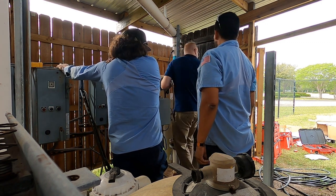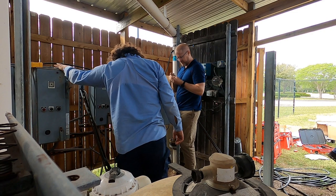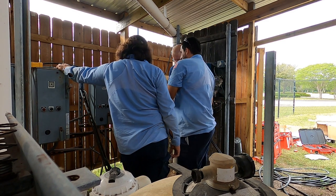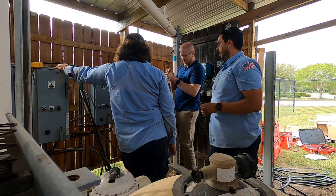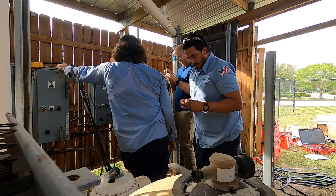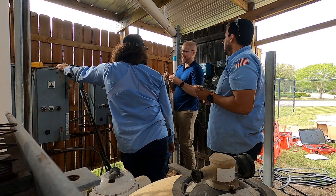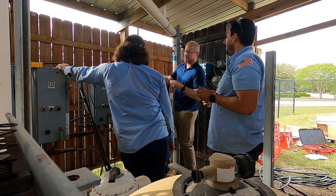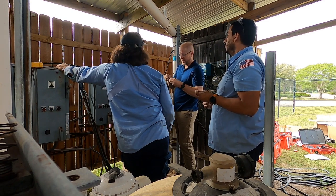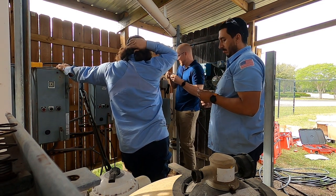Pull this off. Grab my technician screwdriver or the flathead. They're stuck on there. What's the difference between this and the one that you were wanting? That is the one I wanted. I figured out the one that they gave me was the wrong one. They do the same thing. It's just, see how this one has the lugs to put the wires into rather than the pigtail for the wire nuts? I didn't think I have wire nuts small enough for this thing. I didn't care. The sensor works the same. It wasn't the one I was planning on using, so it's fine.